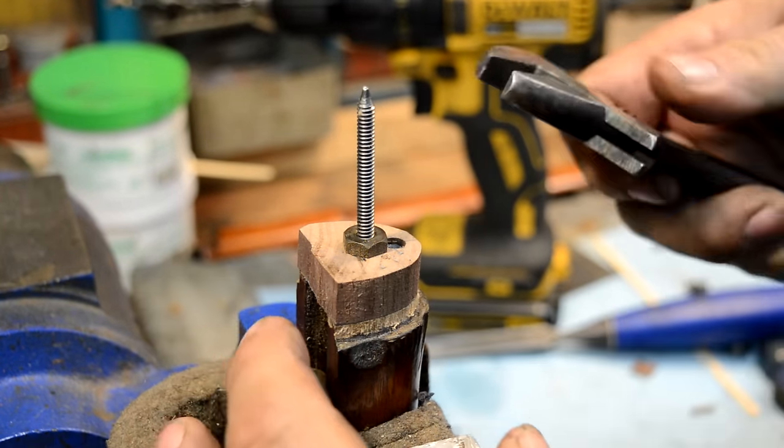I'm knocking the end off of this stick just so that it's a little bit long and it was sticking into a mud hole. There's a dirt escape hole for the ramrod channel, and I wanted to shorten this down a little bit. A lot of work to get that spacer in there, but it was worth it because when we're all said and done, our support screw goes underneath the barrel band screw, goes over the top of the cleaning rod channel, and it's gonna hold all this together at the correct length.